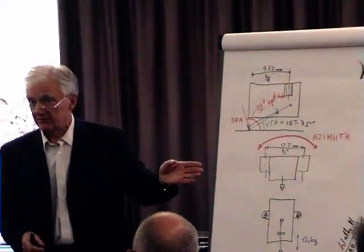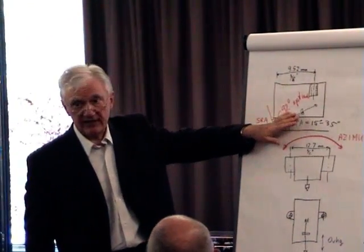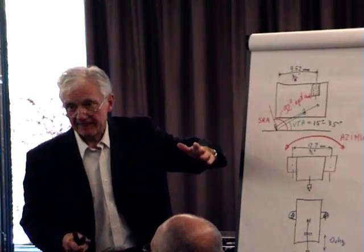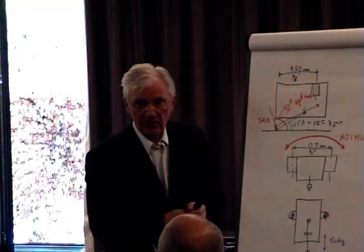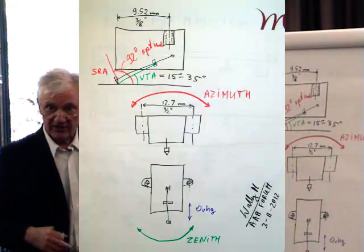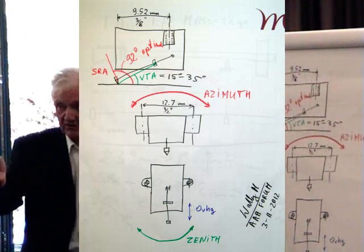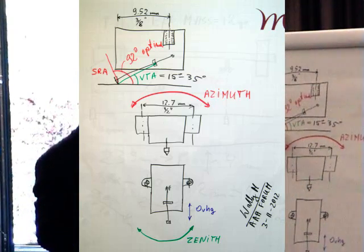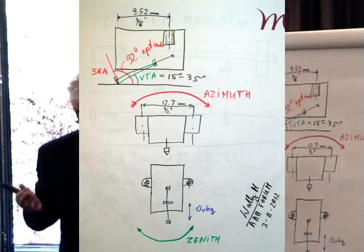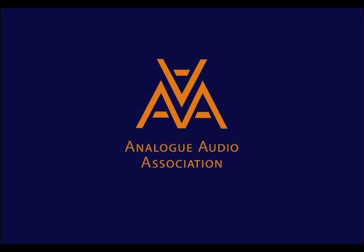Any questions to that? What about your 20%? What angle do they cut? Some of them go slightly below 92, and more than 20% go maybe to 93 — but not more. Why do they have that 92? Because when you grab the hay, the hay is building up. The same is in lacquer — the chips. That's what you cut from the lacquer. It has to go up and be picked up by vacuum, without building up on the cutter. That's pure mechanics.